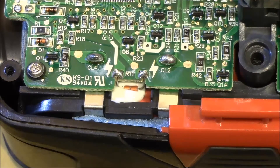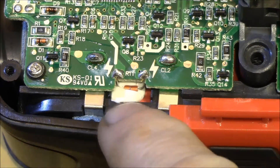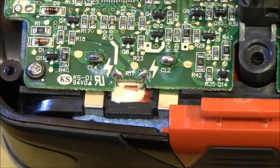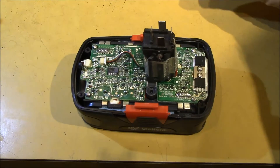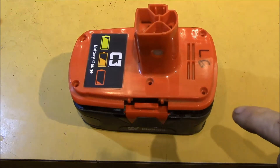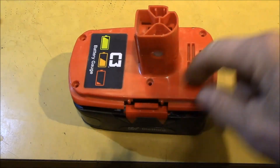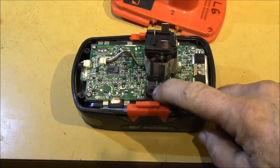On this board you can see resistor R11, which seems to be glued down to one of the cells. This must be a thermistor used to sense the temperature of the battery pack. In terms of mechanical design, the XCP pack actually uses six screws to hold the pack together — four here and then two that screw down and hold the post down.